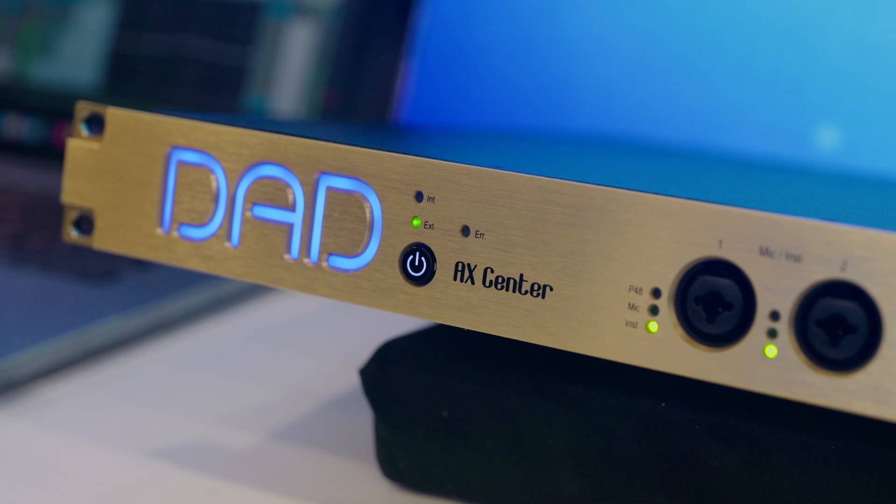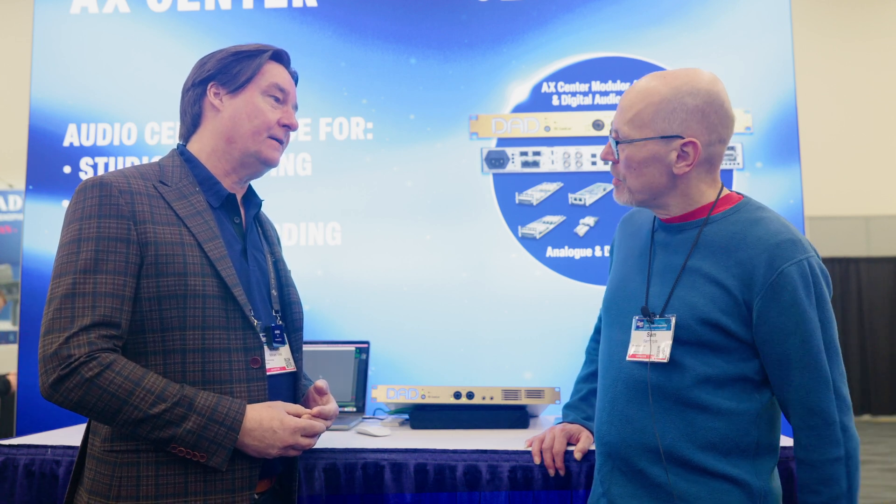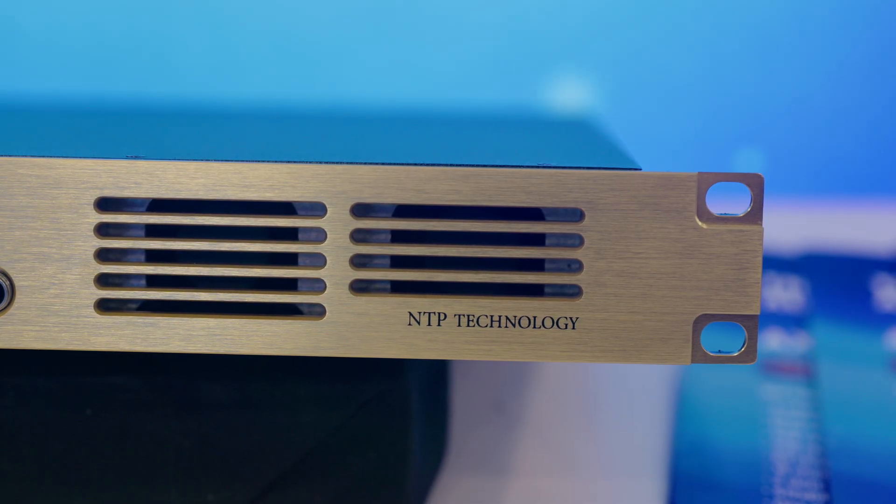So is this still somewhat modular? It's modular with two additional slots. So it works as a 2x8 analog interface, with two additional slots for up to 32 channels of analog. And those slots can host any of the cards in the entire range — the cards we have for the X32 and the X64 can sit here, and coming cards in the future will also be compatible. So the maximum channel count in analog is 32 channels. If it's, for example, two MADI cards, it would be 256 channels. What is also interesting is that the unit is Thunderbolt enabled — it has natively built-in 256 channels of Thunderbolt I/O, Thunderbolt 3. It runs also at 96 in that channel count. And it also has 256 channels of Dante.